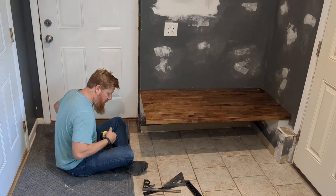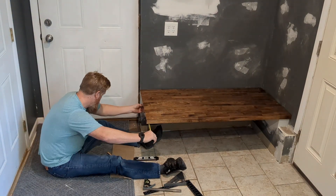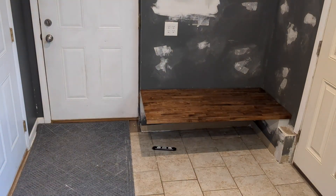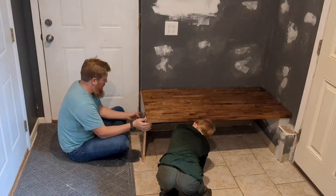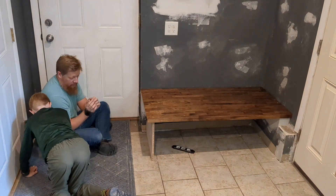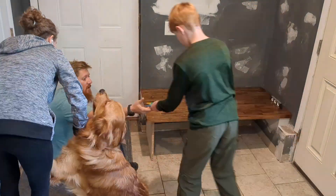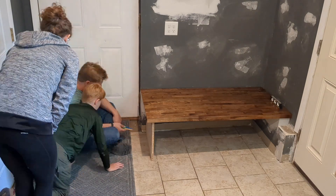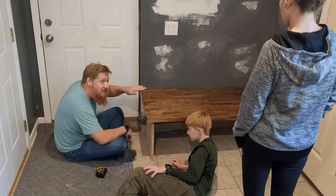In this section I'm actually beginning to install the legs for the butcher block countertop, which is the base bench area. The way we're doing that is we're just building a small little cabinet below it. I'll attach a picture at the end of what the whole thing looks like. Getting this outside piece just right was really the key to everything — setting the depth of it will set where the top piece will go, ensuring that it's straight and perpendicular to the wall behind it when the wall's not perfectly straight. There's just a lot of figuring out here, and the kids were helping me.